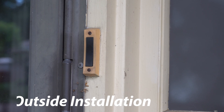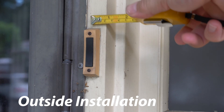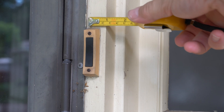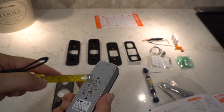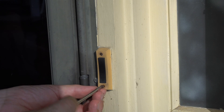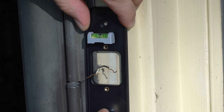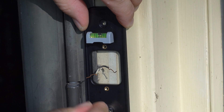So let's install this thing. We only got an inch of space due to the storm door, even though the doorbell is about two inches, so I had to get some thin pieces of wood and tack it behind there. Goodbye, old doorbell - it was just a simple switch. They give you one of those different plates; there's a little bubble level that snaps in there, and you snap it out before you drill. There it is drilled in.